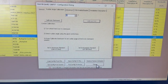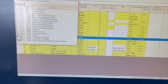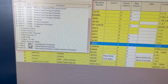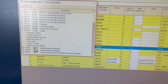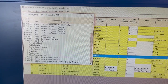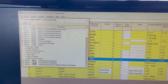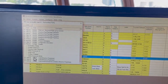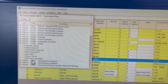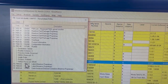I close and reopen to analyze transmitted PGNs. I go to rudder, expand it, and look at the position: 33.14 — close enough, I'm at 34. I go to zero — negative one, not perfect. Then I go to the other side: 33. Back to zero: zero. I do this one more time: all the way one way — 33, excellent. All the way the other way — 33. To center — zero. I'm very pleased with that.